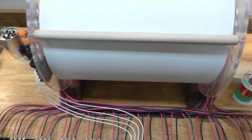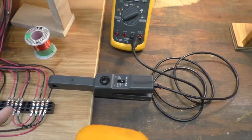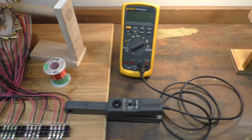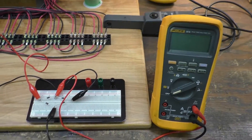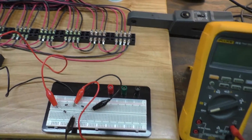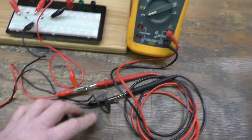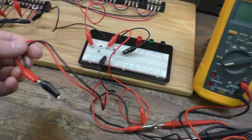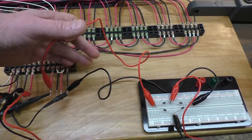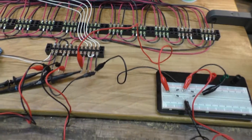I've got an amp clamp hooked up to the primary coil with a multimeter — amps aren't that great yet but I'm working on that. I have a rectifier bridge using standard 1N4007 diodes hooked up to my multimeter, and I'm using the leads coming off of it to charge a capacitor. That's just coming off of the secondary windings of the coil.